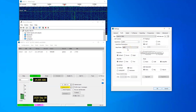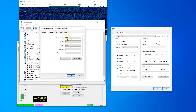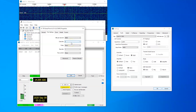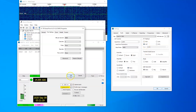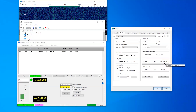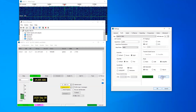The baud rate is 9600. If we right-click in device manager, properties, port settings, you can see it is currently set to 9600. Data bits 8, stop bits 1, handshake none. PTT method is CAT. Mode is data/packet, so that will switch the radio into USB-D mode, and split operation none. You can click test CAT - it should light up in green, which indicates that it's talking to the radio. And you can go ahead and click test PTT, and the radio should transmit.